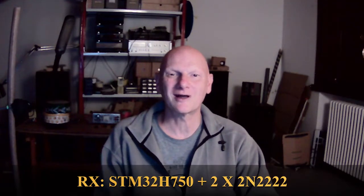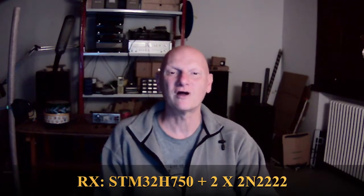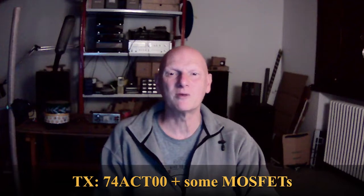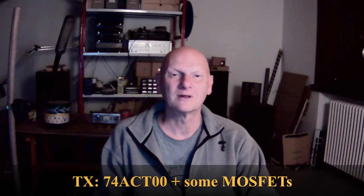Hello, this video is about one of the simplest radios that can be built. It's just an MCU and a few discrete components. A mobile phone or a computer is used as a serial terminal to control the radio and for power, 5 volts from the USB. It's a multi-mode receiver that goes up to the 20 or maybe 15 meter band.